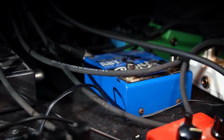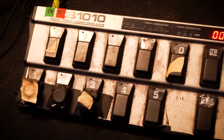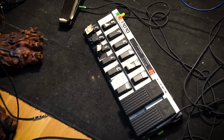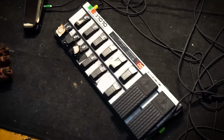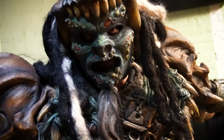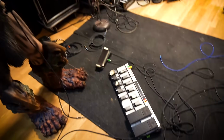I love the radial stuff. If you want to zoom in on this pedal board, I've actually wired this thing so that it takes phantom power. Now, the Voodoo Lab GCX sends, I think, like 9 or so volts down pins 1 and 5. I've actually taken this thing apart, pulled the transformer out of it, put it in another box, and mounted it so I could send phantom down the two unused wires in a 5-pin MIDI cable, because 5-pin MIDI only uses the middle three for, I guess it's MIDI notes, signals, and things like that.